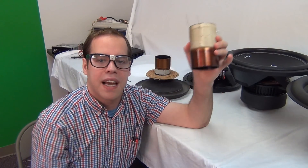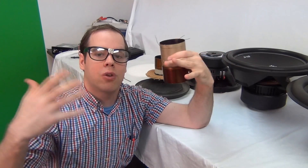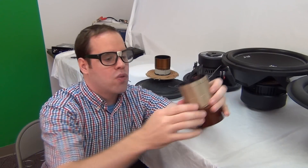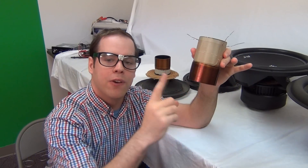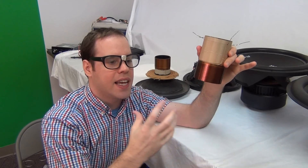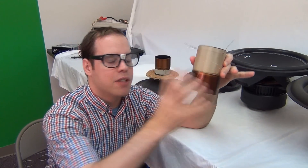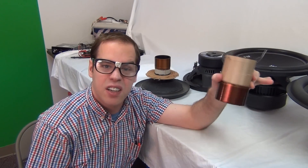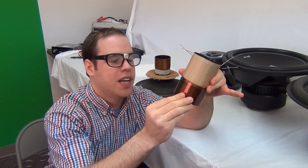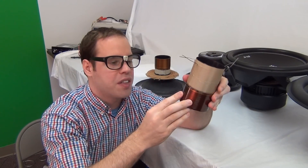Some manufacturers using dual voice coils actually use quad coils all connected. In coil science, when you have a coil inside another one they amplify each other's inductance — each other's magnetic field. With a dual voice coil woofer with four layers, each layer increases the strength of the field of the layer before it. A single voice coil with just two layers wouldn't amplify as much — just two layers amplifying each other versus four. Think about how large a magnetic field we can get with more layers.